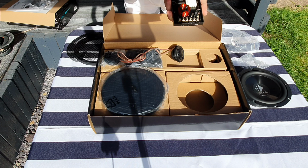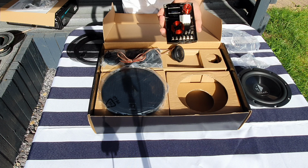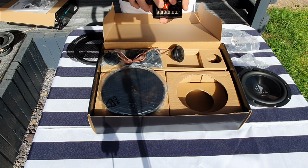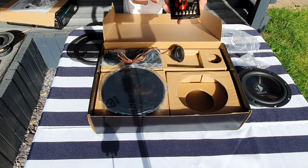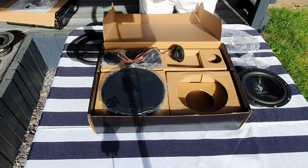Oh, there we go. Top comes off as well, so you can see inside. Random spider running across, or an ant or something. Fairly straightforward in there. You've got various jumper settings. Okay, so you can have plus or minus 2 dB either side. So if you put these on an amp and find the tweeter's too high or too bright, you just knock it down by minus 2 dB, put your jumper setting there, and it tones it down a bit.